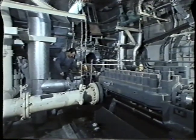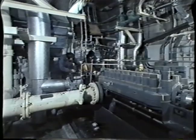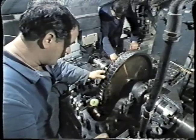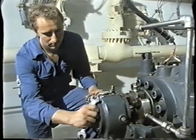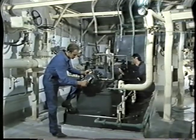The pumps in the auxiliary feed water system are horizontal multi-stage pumps with axially separable casing. Some are driven by a turbine, some by an electric motor. They pump 23.3 litres per second with a head of 1,023 metres.